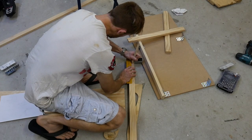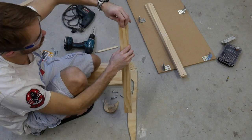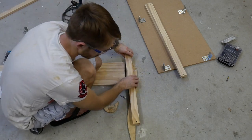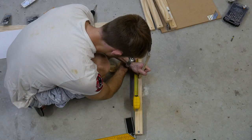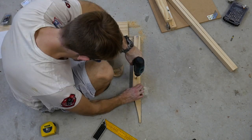After the lengths of timber are cut, I mark the holes for each end and then drill them through. I then use the original piece of timber that I drilled as a template for the second one, locking them together with a bolt so the hole on the other end will be true. That way we can ensure we've got the same length side to side and the thing is not going to be asymmetrical. I then mark up the centre holes for the lower supports to bolt into — see the CAD model for more.